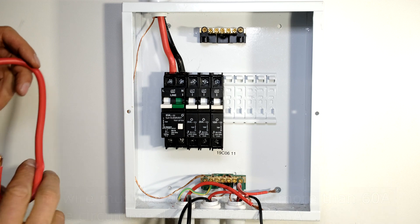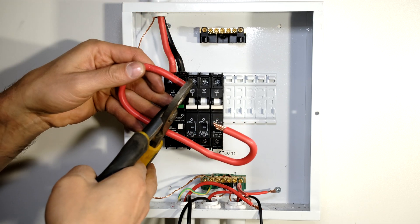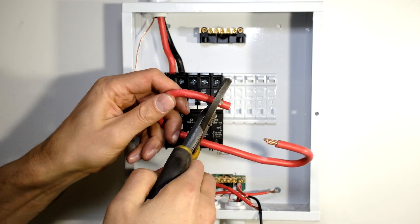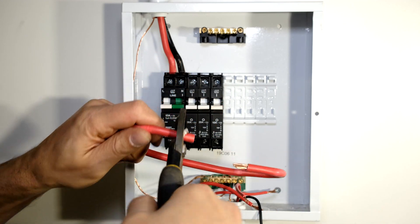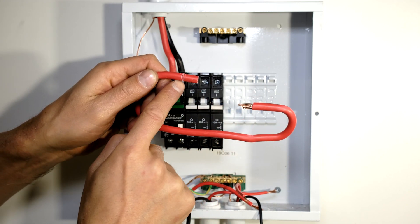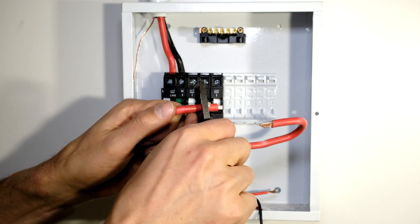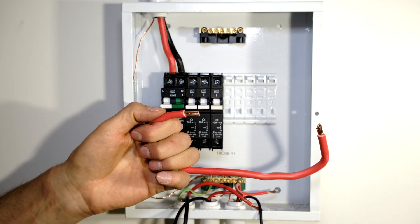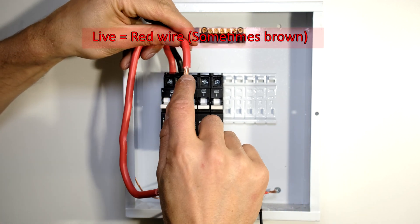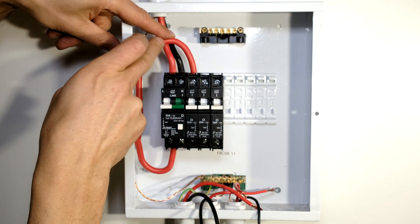Here is the cable I've formed. I'll show you how I cut through the insulation using this tool. I gently make a mark on the cable. What you'll notice is that I do not cut into the copper - if you cut into the copper you will damage it and the copper strands will just break off. I'm actually pulling the insulation off - it's more a tearing and pulling rather than a cutting. There you can see I didn't go into any of the copper strands at all.